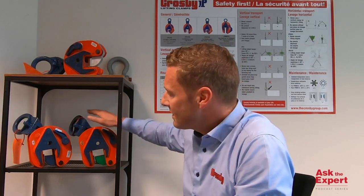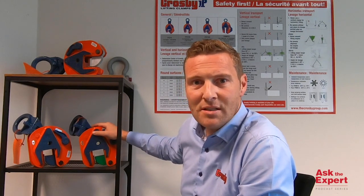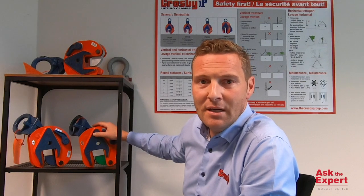Now both clamps have the same size, but this one is a two-ton clamp, while the same size for hard materials is only a one-ton clamp. The reason is that the Hardox clamp needs a bigger clamping force to engage the cam segment and the pivot into the steel plate. For this reason, do not ever change the materials or spare parts between the two clamps.